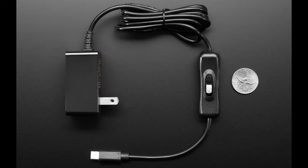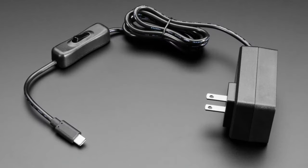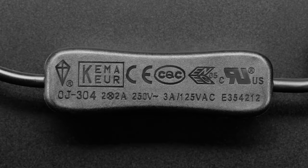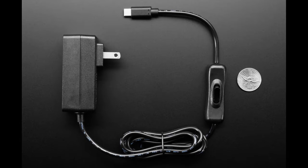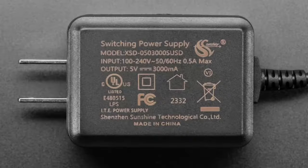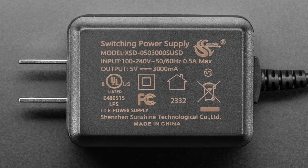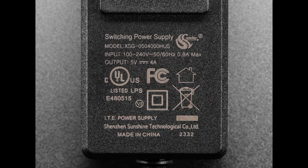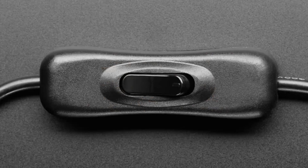The four-amp one is a little more expensive and a bit bigger. These are great for use with your Raspberry Pi 4, which has a USB-C connector, and you can also use them with the Pi 5. Three or four amps will work just fine. If you're using all possible ports at one amp each, with multiple displays and disk drives connected over USB, you might need five amps — but 95% of people do not need a full five-amp supply. That switch is pretty cool because you can really cut power to your entire setup.